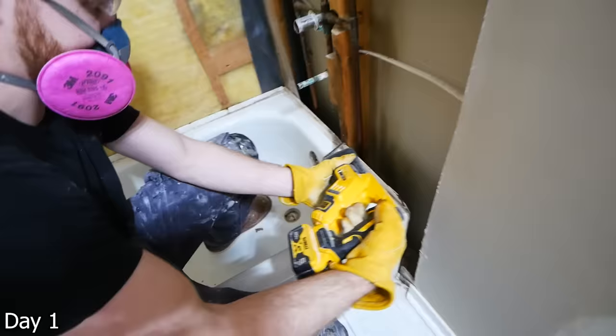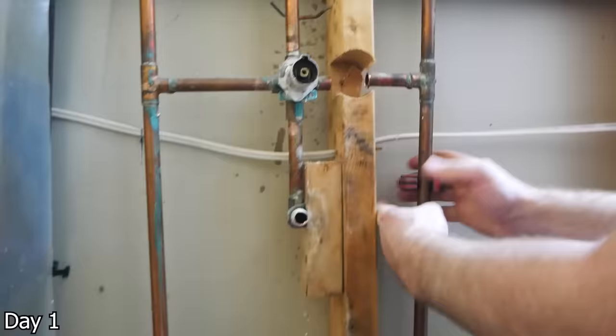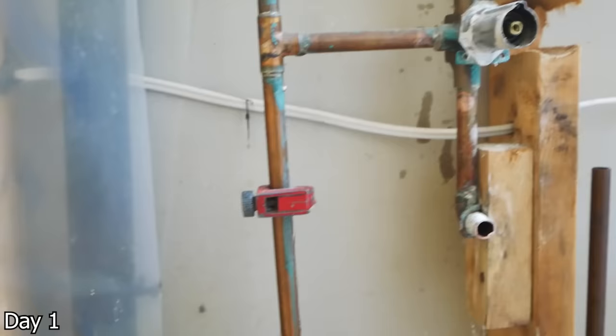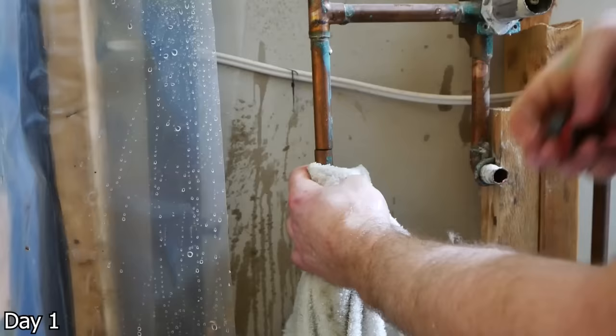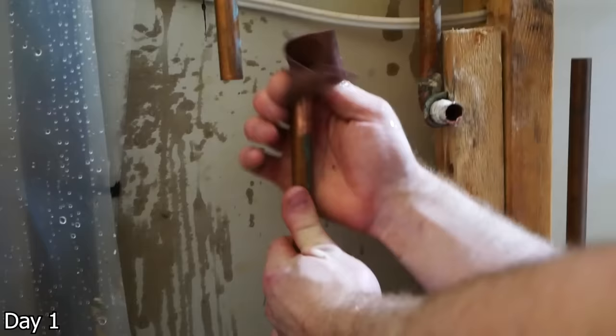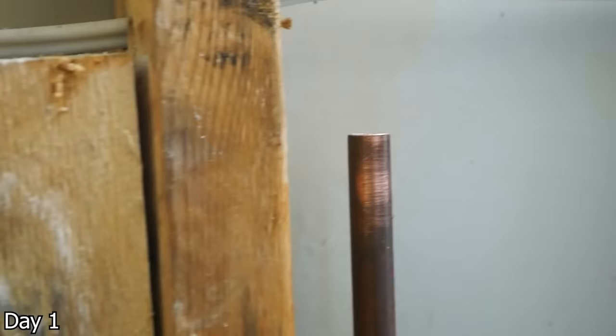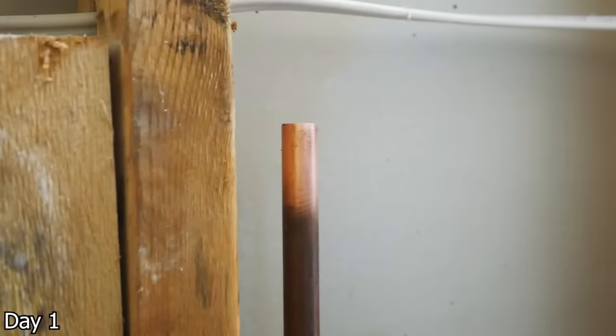The final step will typically just be some fasteners along the tub flange — you can either pry these out or cut them with a reciprocating saw. With all those gone, lift the tub out — get it at an angle and it should come right out. Then, very similar to what you saw under the vanity, we're going to cut these copper lines and cap them temporarily with those SharkBite end caps. We will rework all of the plumbing eventually, but for now we want to be able to get water back on at the end of the demo day, and these caps will allow us to do that.